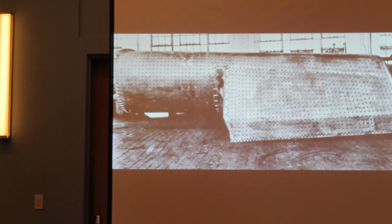Now, welding boilers, we're talking about fireboxes right now. We'll talk a little bit later about the barrel. That was another thing. Now, as we said before, the D&H and the N&W were the first users of welding on boilers. The D&H was actually the first, along with Alco, building an all-welded boiler, the firebox and the barrel, the whole shell, everything was welded. In 1937, it was an experimental, I think it was a 280, experimental engine, and it worked out quite well, but again, there were big restrictions on welding the barrel portion, which we'll talk about in a few minutes.